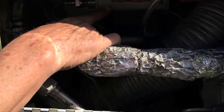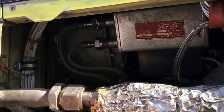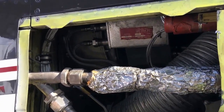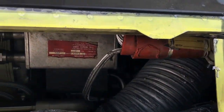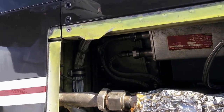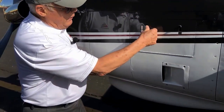This is the exciter box for the spark ignition. This is the bleed air line where it branches into the big and little P3 for the environmental versus the pneumatics. The later airplanes will have another branch off here for the EPA shutdown purge — the fuel purge at shutdown. But no particular one item is really left to inspect in there, even though that's what the door was originally for.